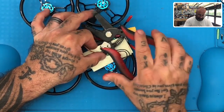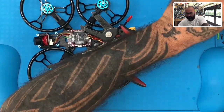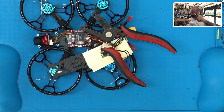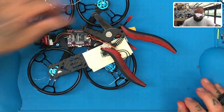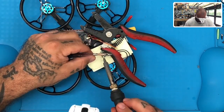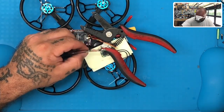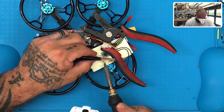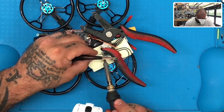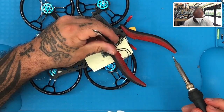I guess you could get all kinds of fancy equipment, trust me, I have it to make this work, but I'm just going to use whatever's laying around here right now. Let me put my old band glasses on though, because I do need to be able to see. All right. Take the solder, and I'm going to tin the pads on the receiver. Okay, there we go. Put the solder aside, now grab the wires.